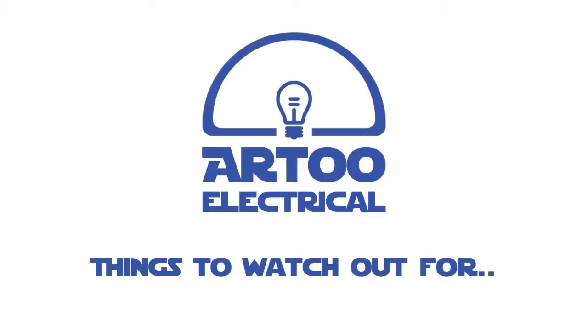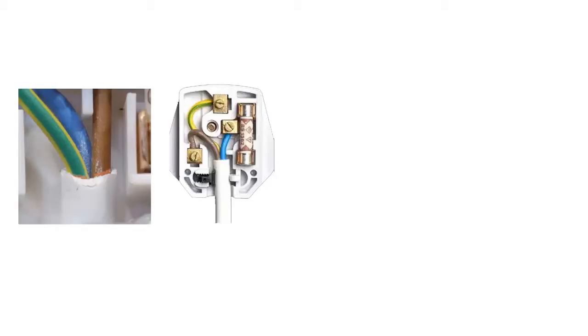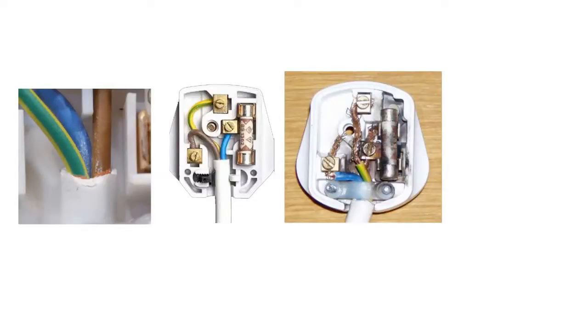You've learned how to wire up a plug correctly, but it's good to look at some things that might go wrong. One of the most common faults is when removing the outer sheath you cut a little too deeply and actually cut into the cables inside, exposing the bare conductors — if this happens, just snip all the cables off and start over. In a second dangerous example, at first glance everything looks neat and tidy, but the brown and blue wires are in the wrong places. In a third dangerous example, there are far too many exposed wires — the earth wire has probably touched the live wire, causing a spark, a fire, or possibly electrocution. The neutral cable hasn't been cut correctly, and the cord clamp isn't actually clamping the outer sheath, so a tug is likely to pull things out. That's an example of how not to do it.